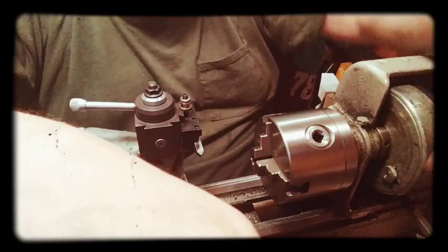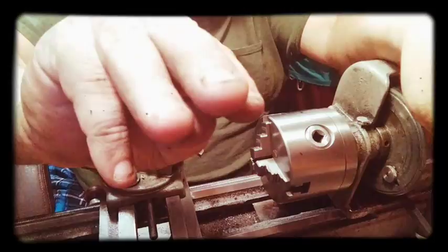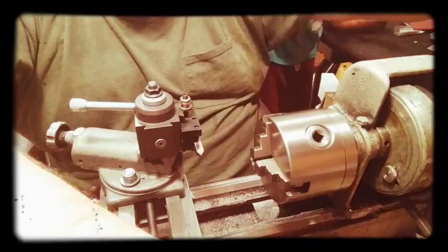Right, when you tighten this bearing down, it pulls it into a tapered hole. The hole in this casting right here is tapered. The harder you pull it in, this bearing is split four ways. It's split like this, and it comes together like this and squeezes on the shaft. Like that. Okay. So if this back bearing is pulling, then it's this front one that is letting the chuck raise up and down.